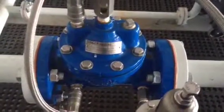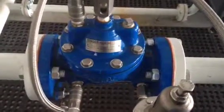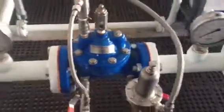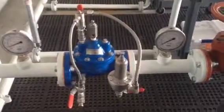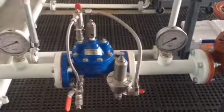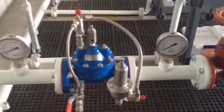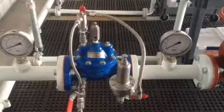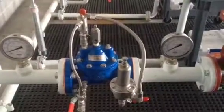In this video demonstration, we're going to talk about the single rolling diaphragm that Singer valve has on any valve that's 6" and larger. Right here is just a little 2" flat diaphragm Singer valve that we have in our control valve loop. I'm going to do a demonstration on the 2" to show the chattering that happens on a flat diaphragm. I imagine most of you are aware of that. We're going to get this valve to chatter at low flow conditions, and then I'll show you the 6" condition where we'll be able to actually flow less water than the 2" and have it perfectly stable.